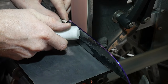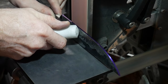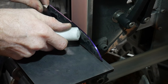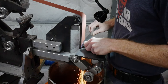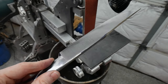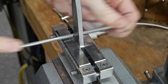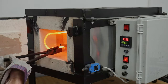With the template laid out on the blade, I ground in the profile and roughed in my bevels to a 36-grit finish on my North Ridge 2x72 belt grinder. It's taken some practice, but using the work rest grinding method with a Teflon push stick has really become my favorite grinding technique. With forge scale on the blade, the push stick can become a little caught here and there, but once you have it smooth, life is easy. I used a file and my file guide to rough in the shoulders, however I did end up going back to clean these up with the mill after heat treatment.